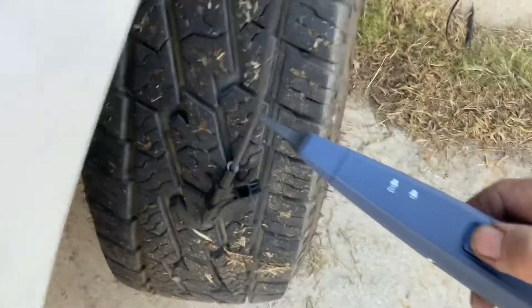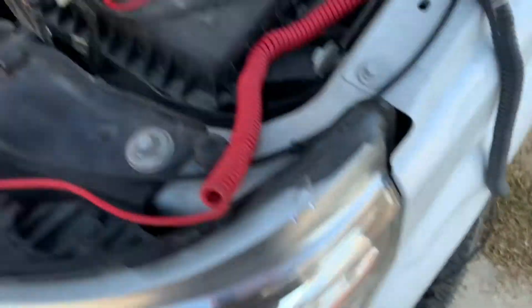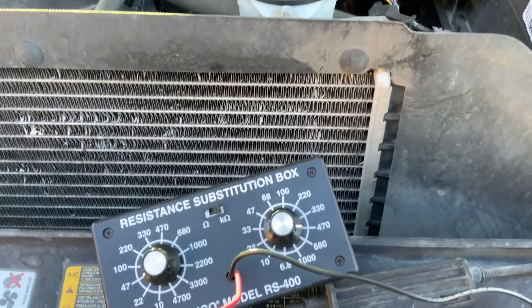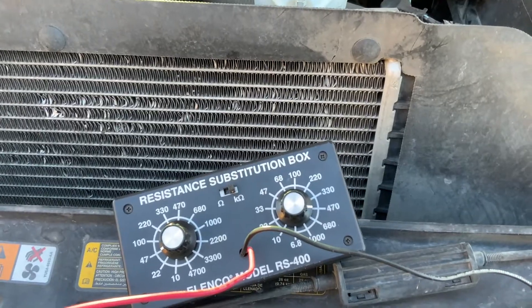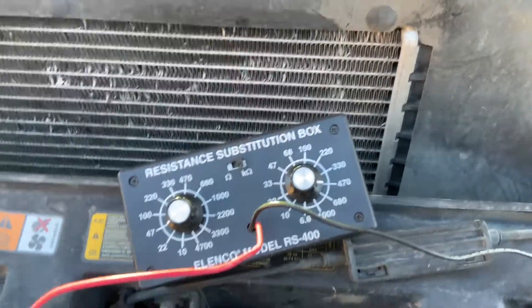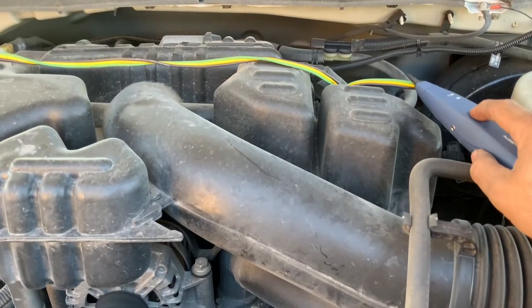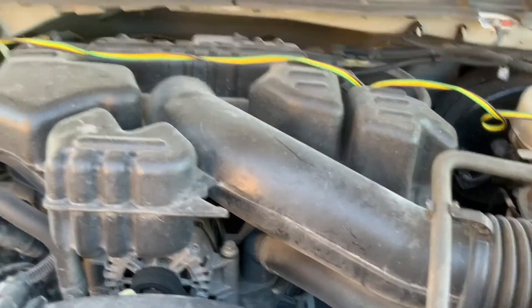Still transmitting — and I've got this lead right here and you can see it's still going. That's the beauty of the tool — even with resistance in there, which I showed you at 485,000 ohms, it's still toning, still telling us where the wire is going. You can see it just going right there.